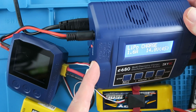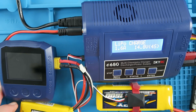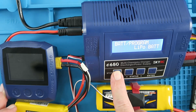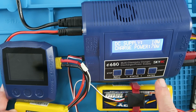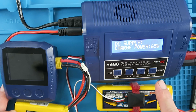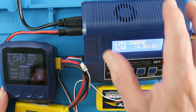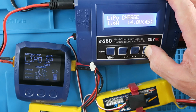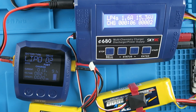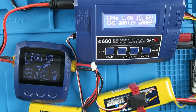What happened is you can see the flashing red indicator here, which means the output is overloaded — we're going to need more headroom to power this charger. Going back in and setting it to 15 watts, it seems to be happily charging. Starting the other battery charging as well — things are happy, this one charging at 1.6 amps and the other at 1.3 amps. Quite a useful feature.